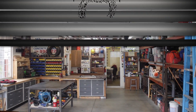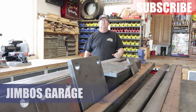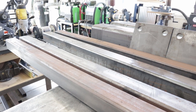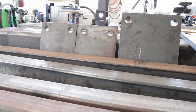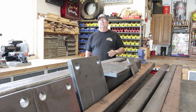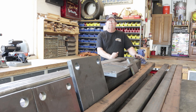Welcome to Jimbo's Garage. Good afternoon everyone. Today we've got ourselves a steel column welding project. We've got four three-inch square tube by 0.25 inch, and we're going to be welding some three-quarter inch steel plate to the bottoms of those. We've also got two six-inch square by 0.375 inch thick columns, and we're going to be welding some one-inch thick plates to the bottom of these. We're using the SMAW shielded metal arc welding process, which most of us in the United States commonly refer to as stick welding or arc welding.